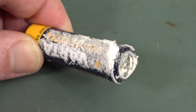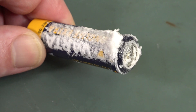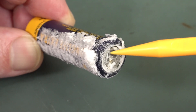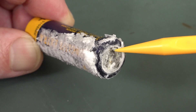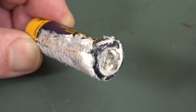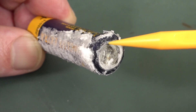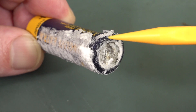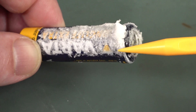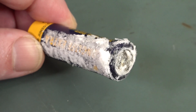I just looked through a random old battery box and found this VARTA — a made-in-Germany VARTA battery — and wow, that is a shocker. What you're looking at here is leakage of potassium hydroxide from the battery through the seal in the negative end. That potassium hydroxide forms with carbon dioxide in the atmosphere, creating all these little dendrite-y crystalline structures that you see here. It's rather funky to look at, actually.